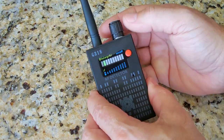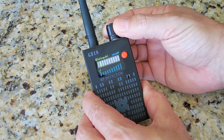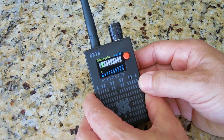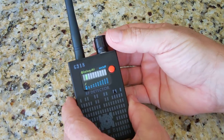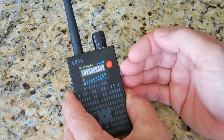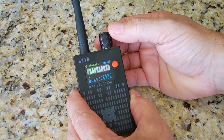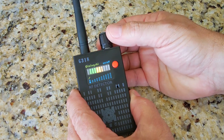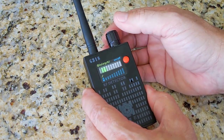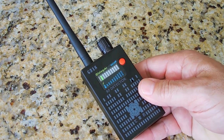To power it on, push the button — and this is your sensitivity adjust. You want to see maybe a couple of bars after the green one, so just rotate a little bit. Orange means you're getting closer, and red means you're right on top of it. As you get closer, the audible sound is going to go faster and faster. If you're sweeping a room and you see it starting to go into the orange area, decrease the sensitivity by bringing it back towards the green, and start looking at different areas of that room. The more you decrease sensitivity, the closer this has to get to the wireless transmitter in order to identify it.